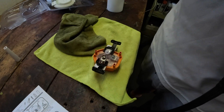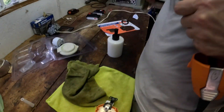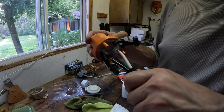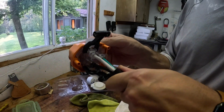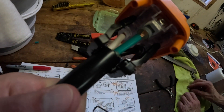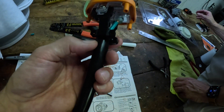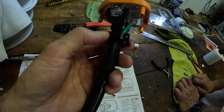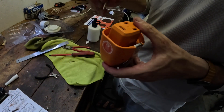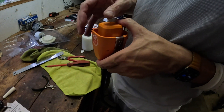Same as we did on the trailer end: the black goes into the black, white into the white, and your ground cable goes into the green — in this case there's green housing on the outside of our ground wire. Each of the three wires has been put into the corresponding hole, and now we're going to tighten down the cable clamp on the main housing of the cable. You want to make sure that it connects with the main housing and not the wires, so that you have proper strain relief. We've pushed the outlet housing back in through the casing and now we're going to screw it in — and we're just about done.